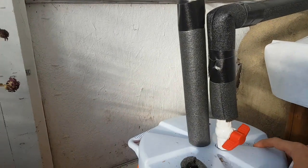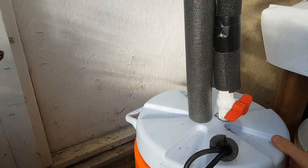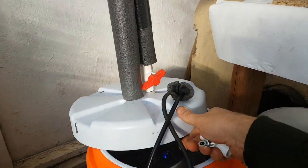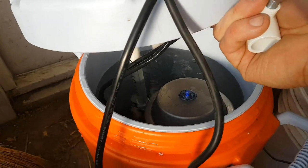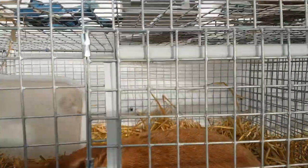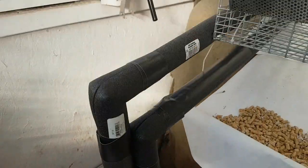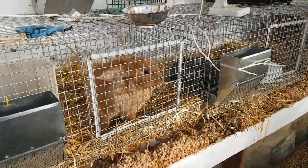Inside of here - my Rowan must have screwed this on a little bit too tight - it's one disadvantage of the screw-on lid, and I probably should have gone through the side to make it easier. But inside we've got an automatic water heater that's just floating on top, using a very small amount of wattage, and then the pump. Five gallons of water for four rabbits will actually keep them watered for up to eight days, which was my intention - I didn't want to have to come out and change frozen water bottles every day. The system seems to be working really well, though I have been having an issue trying to get the bunnies to drink from it. I guess it takes a bit of time to train them.